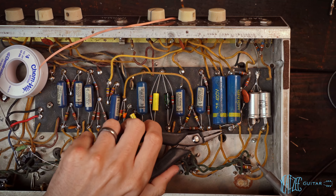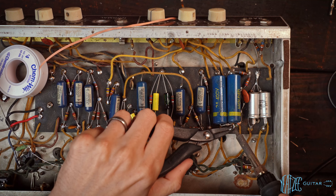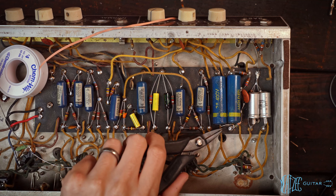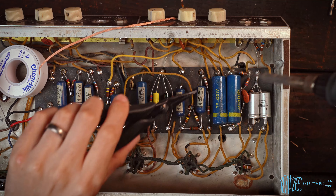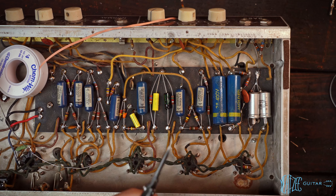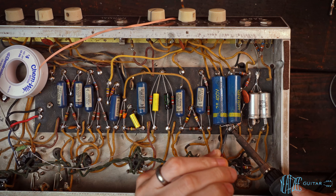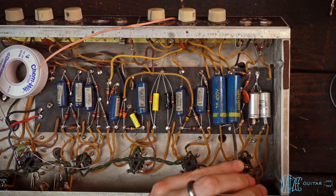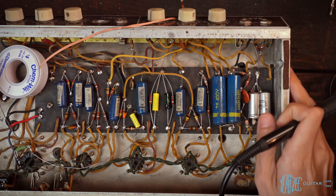I'm not sure what's going on with these big caps here. We got these all done. That looks fine. I'm really not sure what's going on with how this is connected — it looks pretty janky. According to the schematic, they are supposed to both meet at this eyelet. These could be factory for sure, but I'm just really not sure. And there's a really bad little carbon film resistor hidden beneath them as well. So we can pull it out — that one's pretty rough.